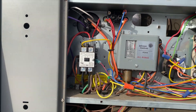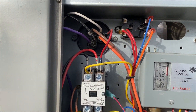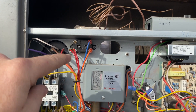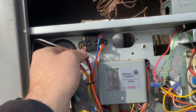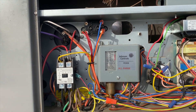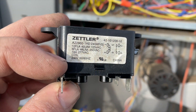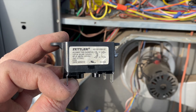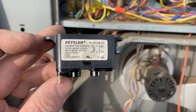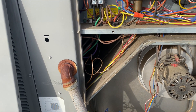We're going to try to find a relay. I have one, but I'm not sure it'll handle a 240-volt coil — I've never seen one like this with a 240-volt coil. Worst case, I'll keep it bypassed so the fan is always running, at least until I can get a proper relay ordered. It is a 240-volt coil, so we're definitely going to need to order one.